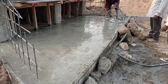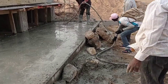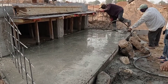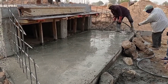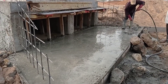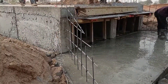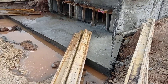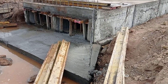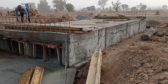The thickness of our concrete walls was maintained at 25 centimeters or 250 millimeters. The height of our culvert box was maintained at 800 millimeters while the width was maintained at 1.2 meters. The height of our wing wall was maintained at almost 1.1 meters, while it ended at a height of almost 800 millimeters.